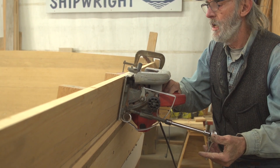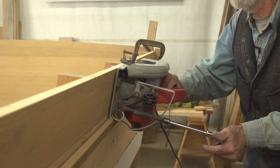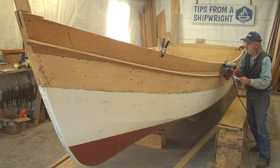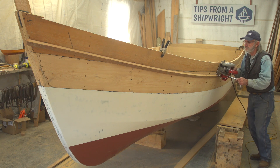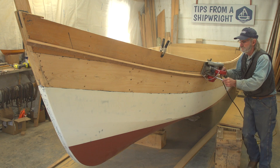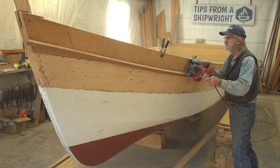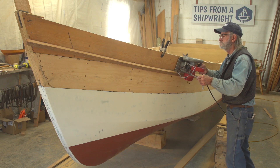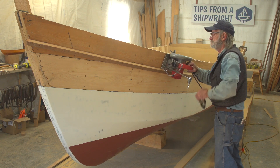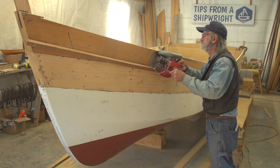The degree readouts are kind of not in the right spot for me, but one degree is one revolution on that handle. So as long as I keep track of that, I know exactly what number I'm on, whether I'm going downhill or going uphill. I just keep looking ahead at the frames and coordinating the degrees on the saw to that angle and it cuts nice and smooth. It's a progression — you really have to stay with it very carefully so you don't make a big mistake of any sort.